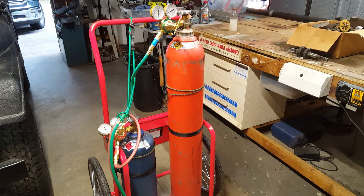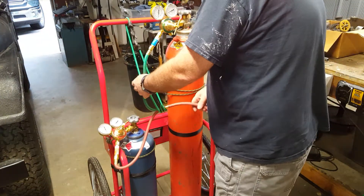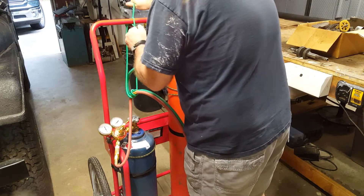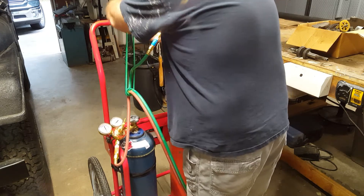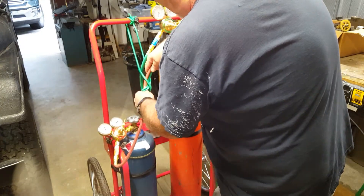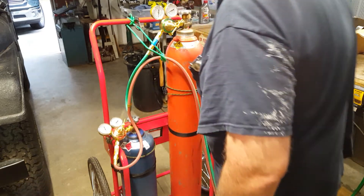By the time you bought the torches and the cart and everything else and paid those prices, you're way up there. I've looked at a lot of videos, up to 10 years old on oxyacetylene - it seems to have petered off, people not brazing a lot these days. And the thing they don't show is supporting your cables so there's no weight on them. That was a big thing at Rolls-Royce - supporting your cables, feeding them through so you don't get any dramatically sharp bends.